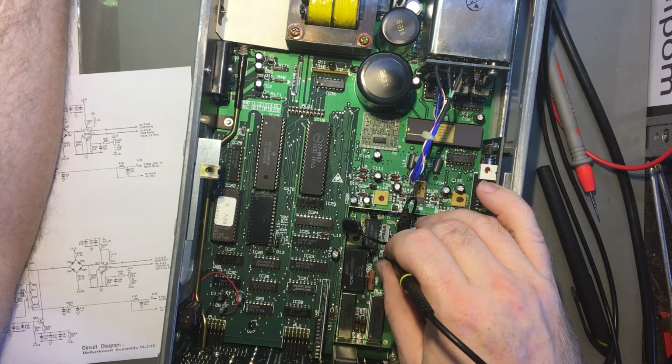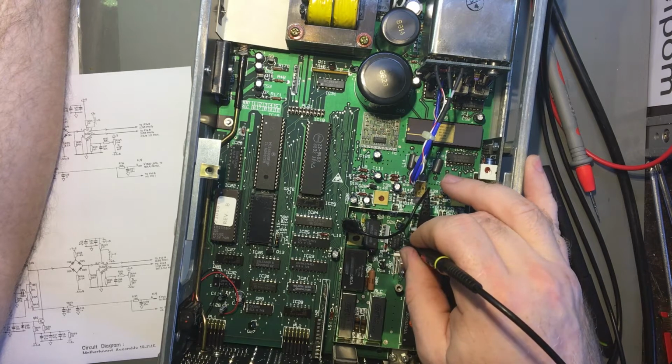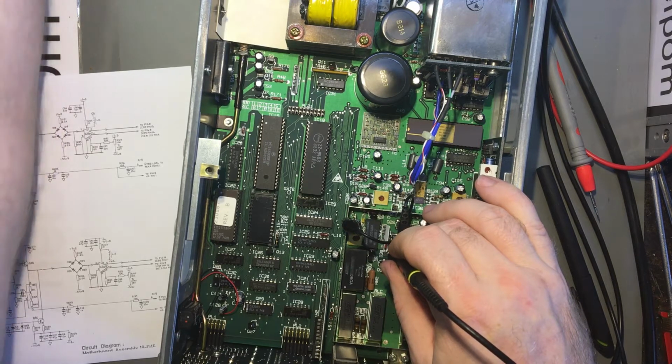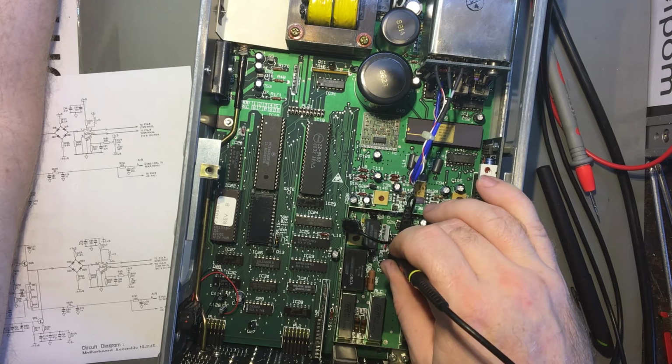So I'm getting a difference in voltage now. I'm getting 10.6 volts here now. Negative 10.6 volts. That one's still the same. So I'm suspicious about that power rail actually. Could be some noise in there. Yeah, you can see a little bit of noise in there. If I slide right down, speed the time base right up, then the voltage reading is dropping and I'm seeing some noise.